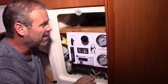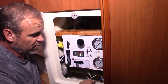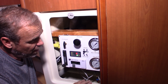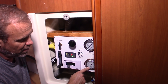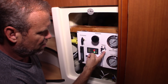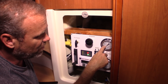Basically, water comes in from the sea up front, goes through the pre-filter and then through the 10 and 20-micron filters, back around to the high pressure pump and over to here. We have a low pressure line that goes up front so we can see our boost, and when our boost gets up anywhere between 5 and 10 psi, that's plenty for our low boost. Then we turn our high pressure pump on, watch our needle over here, and slowly start to apply back pressure to the system by closing this valve — turning it to the right — and watch our high pressure needle start to rise.